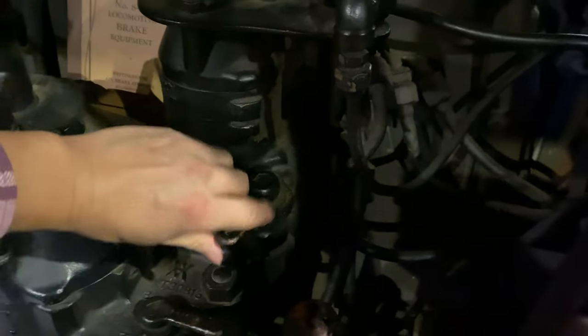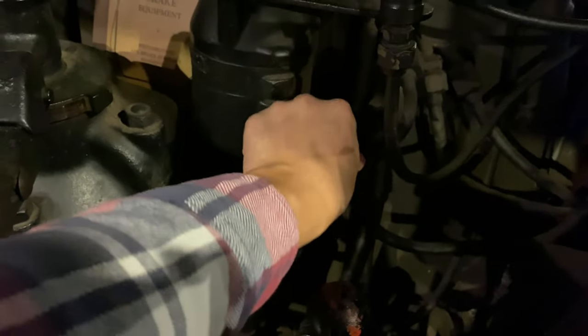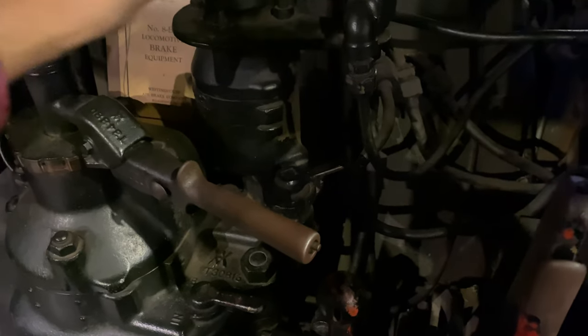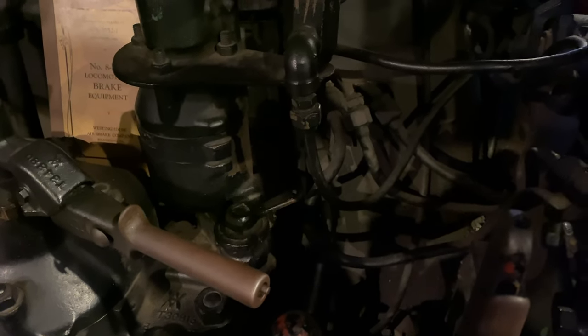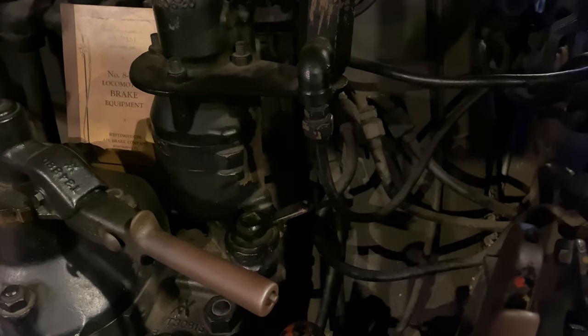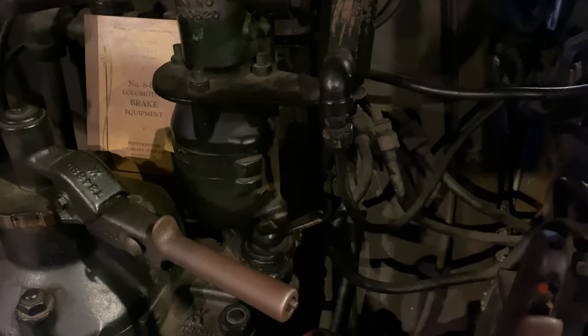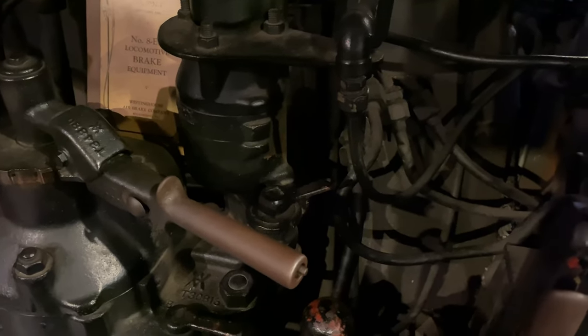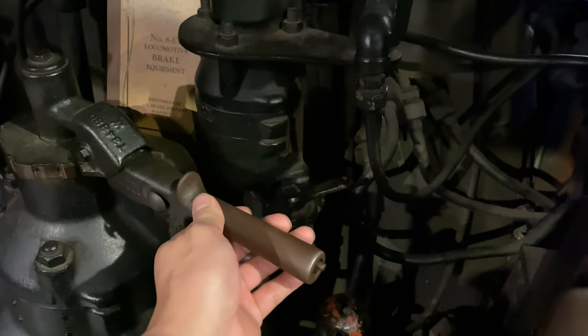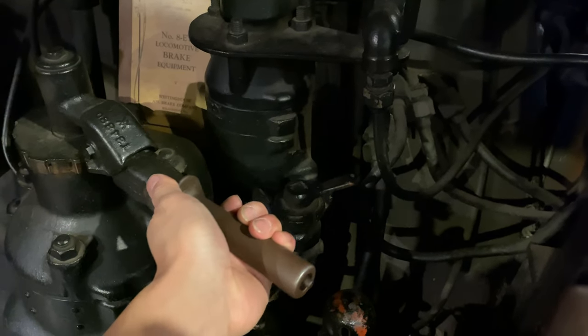So if I were to cut in the controlled emergency brake cock, and I were to need to dump the train, the emergency brakes on the locomotive would apply at a much slower rate, meaning that the slack action between the first car and the tender would be much lessened. You would have a much lower chance of derailing your train or causing any other problems that would be undesirable during an emergency brake application scenario.